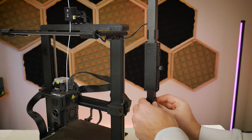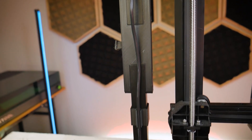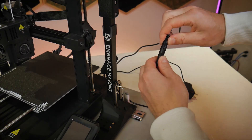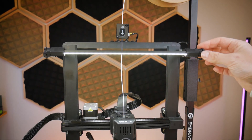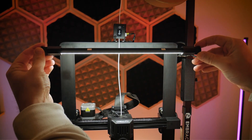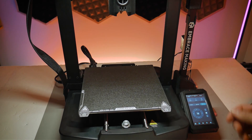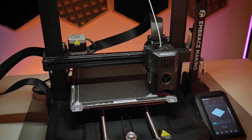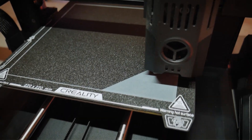You can route the wire and the inline switch along the back of the universal spool stand, which is a really nice way to hide that wire as well as provide a convenient location to reach the inline switch. The last step of the installation is to attach the power supply where you'll find another male to female barrel jack connection — these are again twist locks so they will not accidentally come apart. Then we can power on the LED bar and you'll see these knurled knobs at the top; twist them to change the angle of the LED bar. In most cases I like them facing straight down, but if you have your printer up on a higher shelf you can twist them one or two notches away to avoid glare. Now you can enjoy much better visibility when printing, and with the nice color rendering index rating of these LED bars, if you happen to be doing photography, videography, or time lapses of your prints you'll enjoy the benefit of nice natural looking colors.